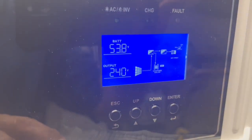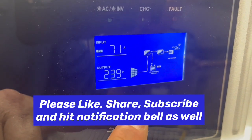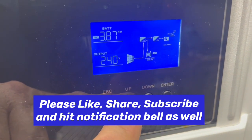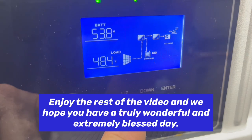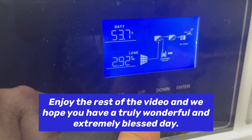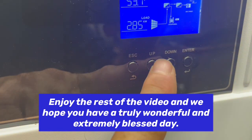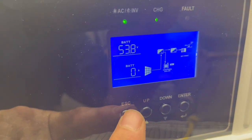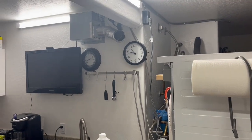Now on this one, this is the upstairs 3.5 ton. And this one is bringing in 71 amps. The PV solar panels are bringing in 3.87. And down here, our load is 48% on the 6 kilowatt inverter, and we are using 2.85 kilowatts. And once again, we're not draining anything on our batteries. And our 48-volt battery bank is staying at 53.9 volts. And it is almost 11 o'clock.